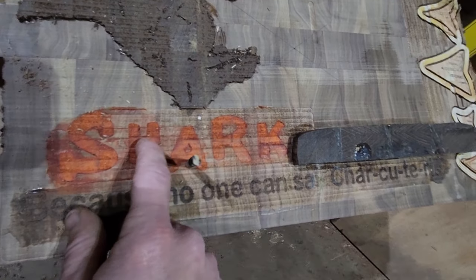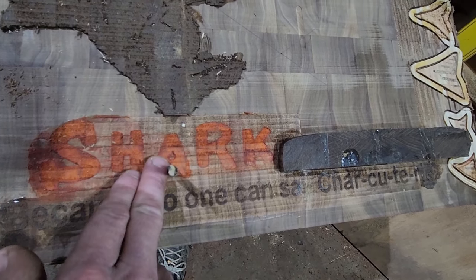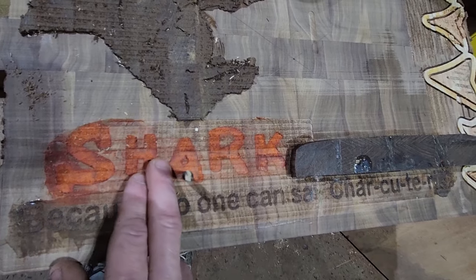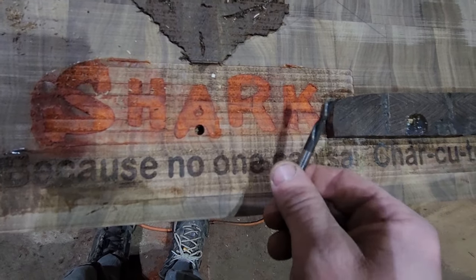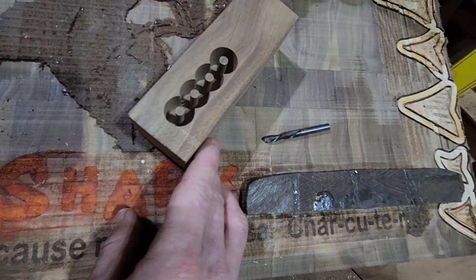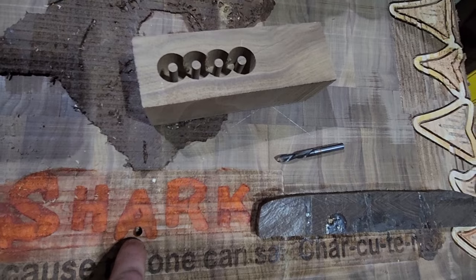In this case, the shank size is a quarter inch. Then in your carve software of your choice, draw a circle that size. I also made one slightly smaller, 0.2455 to be exact. Next, I told it to run a profile pass around the outside of that round vector that you just created. This way, I have two options: a snug fit and one that allows for the glue void.